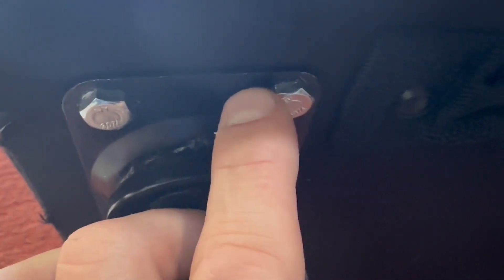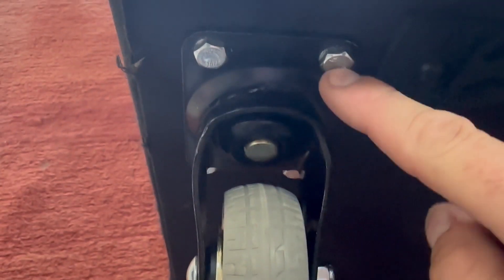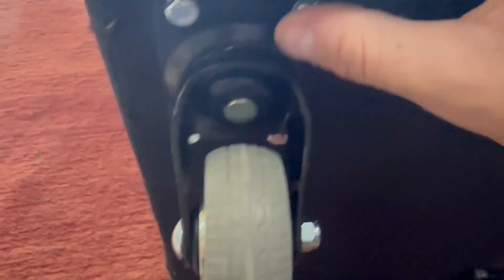Here's another thing: you can't use a washer. Make sure your hex bolt has a nice flange — a normal hex bolt will work. Because if you use a washer, which I did — I learned the hard way, obviously one of my trips to the hardware store — it lifts up the hex bolt too much and then the caster bangs into it. It's metal on metal. You just use the hex bolt into the hole of the caster wheel.